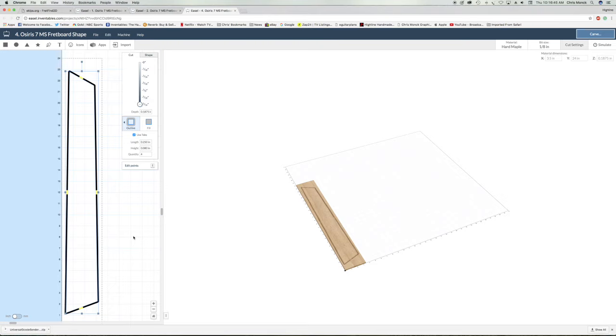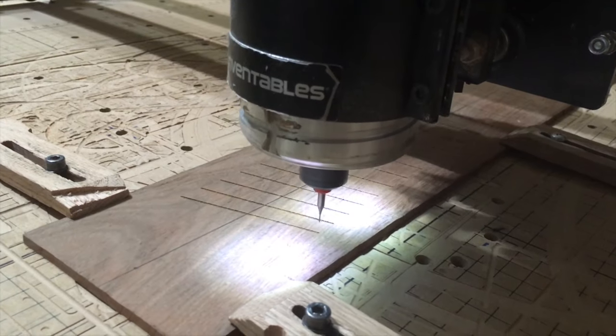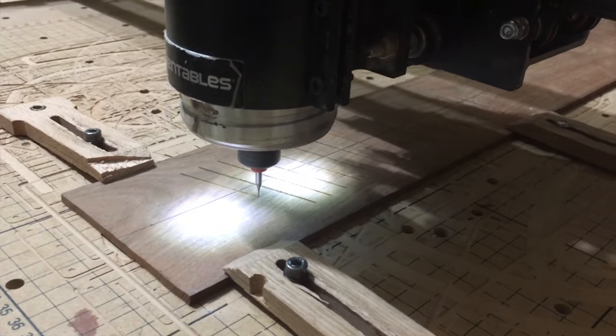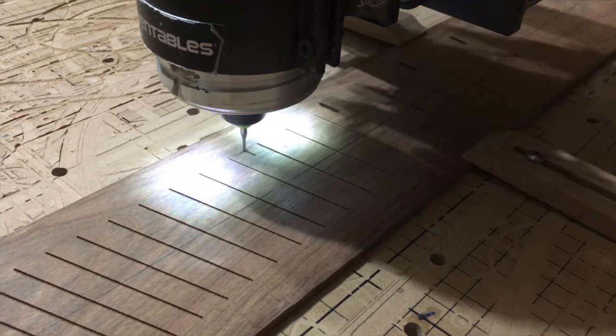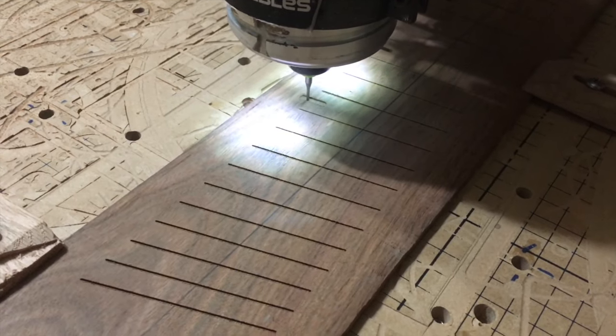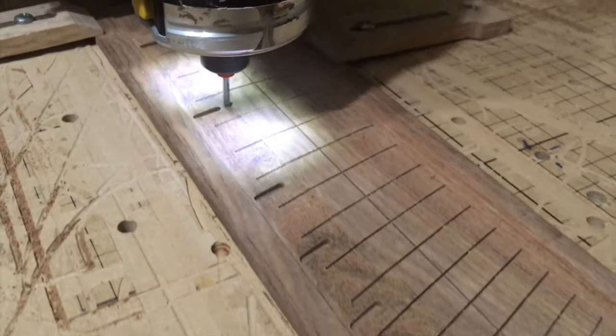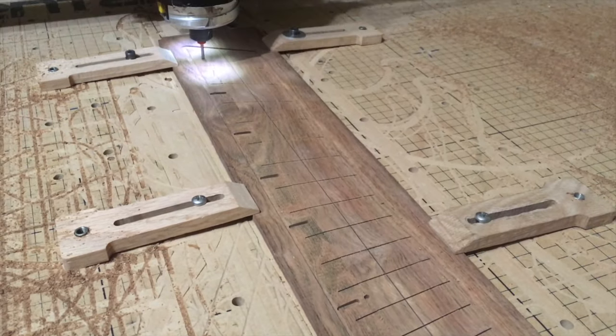At this stage, all I need to do is a light sanding to remove any remaining tool marks — sometimes a few very light ones — using 220 to 400 grit. Then I can install my frets. Then I can take that fretboard and glue it down to the neck. However, before I can glue it to the neck, I need to make the neck. And that's what I'm going to talk about in the next episode of From the Luthier's Workbench. So stay tuned. See you next time.